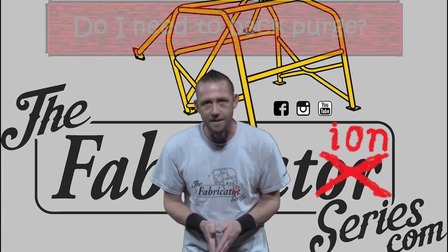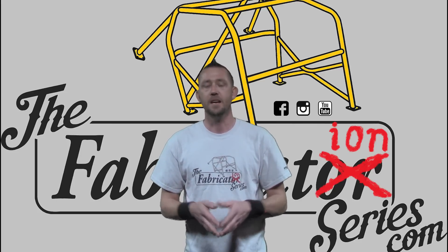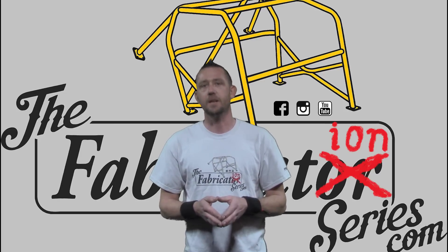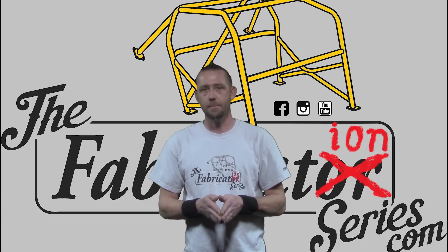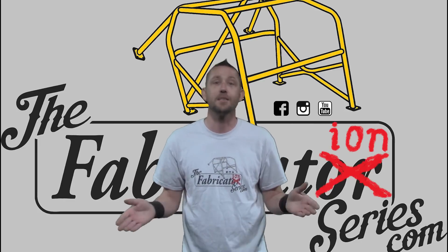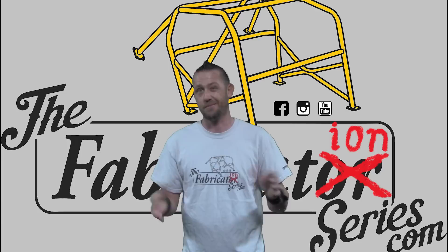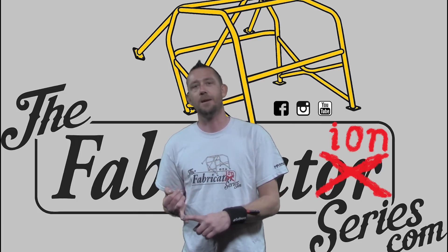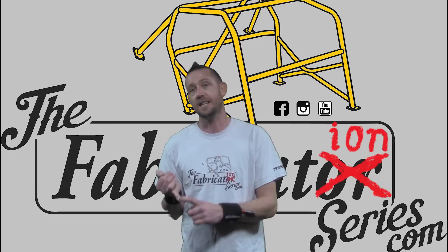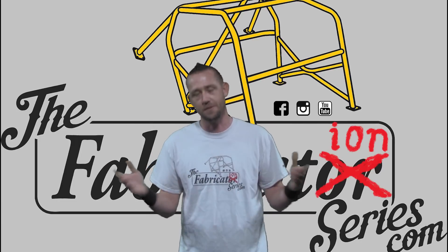The answer is very simple. Is your weld going to be exposed to any elements? If yes, it needs to be shielded. If your weld is not going to be exposed to any elements, the answer is no. If your weld is structural and exposed to the elements and needs to stay true and pass, then yes. If it's not structural and you don't really want to mess with purging, then the answer is no. At the end of the day it's up to you. Me personally — if the backside of that weld is going to be exposed to any atmospheric elements when I weld it, and it's a reactive metal like stainless steel or titanium, it better be purged, especially if it's got my name on it.